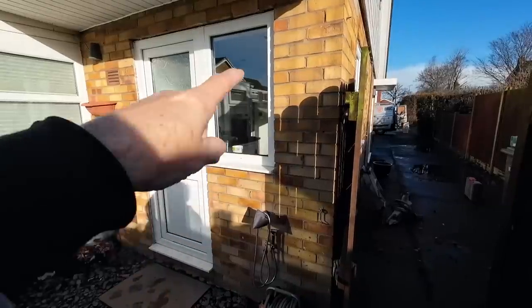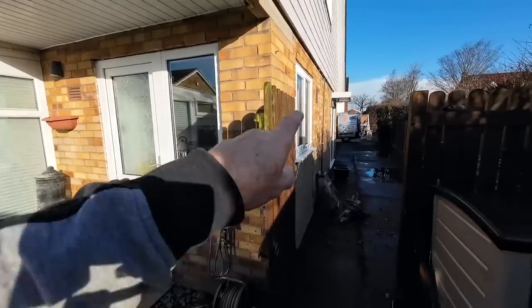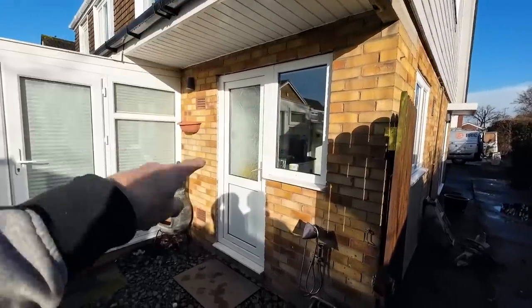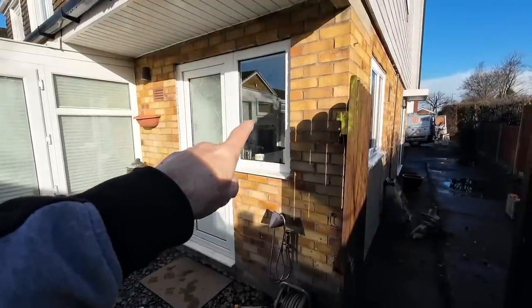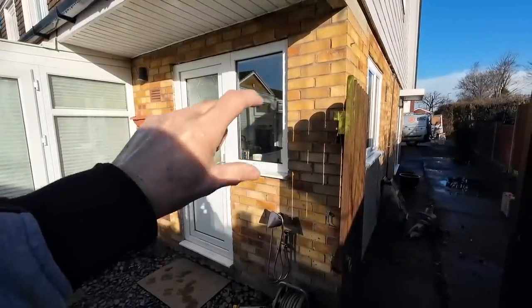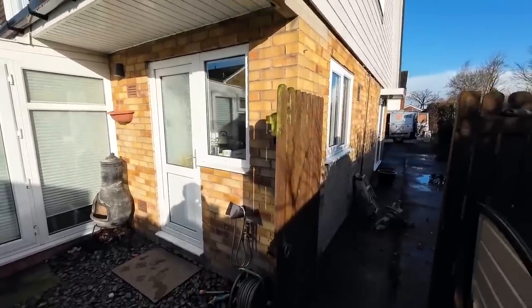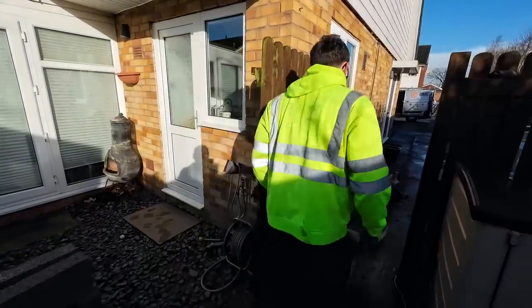face work, block work. So I think we'll be able to, it's got an opener on it, so we'll be able to take that opener and actually fix that window onto this side. On this side, we'll put some screws in, some of the long grabbers, stick them out about 3, and actually build them in as we go. So that's it. There's a lot of toothing to do, quite a bit of a mess, but this is just our kind of job.